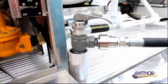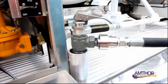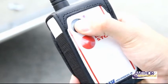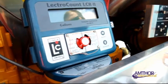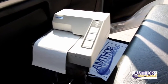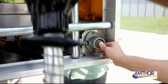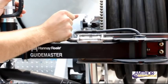Use the nozzle control on the hose to turn the flow of liquid on and off. Once the desired amount of propane is delivered, cut your nozzle control off, then turn off your PTO using the remote control. In the meter compartment, turn the selector dial on the meter to the print position, which sends a command to the printer in the cab to print a receipt for the completed job. Using the hose reel rewind button, reel your hose back in and re-lock by engaging the pin on the swing arm.